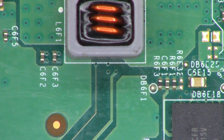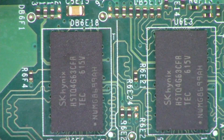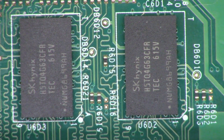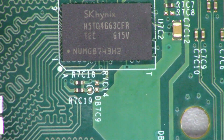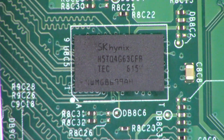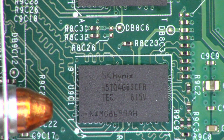I've looked over the entire board, including under the heat sink, even with a high power flashlight and a magnifying glass. I've checked over all the BGA chips that I can easily access — all of these RAM chips right here. There's a whole bunch of them that go all the way around the processor and they all look really good. I don't see any issues with those. I don't see any corroded balls underneath. I haven't seen any issue with this thing whatsoever. I think they might've just been scared with the word water damage, but I think at this point I'm just going to plug it in and see if the power supply is actually making voltage and we'll see if this thing even tries to power up.